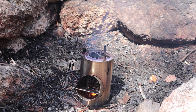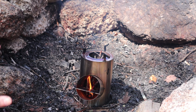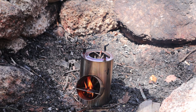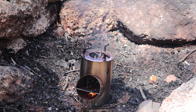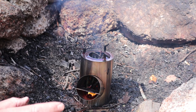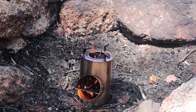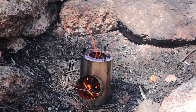Some of the wood I discovered as I snapped it is not as dry as you might always want. Here's the cool thing about this stove — as it gets hot, the heat retained inside of these walls will make combustion much more efficient. The walls will stay cold on the outside for quite a while. What I have found is that because it's a small stove and you're feeding a lot of wood inside, if for whatever reason you don't maintain the flame and run down to coals, you throw a few sticks in through the feed ramp and all of a sudden they're back in flame because of all the retained heat. It just stays hotter much longer.